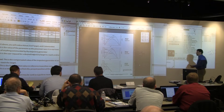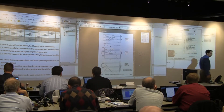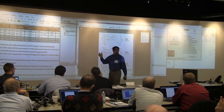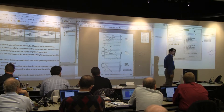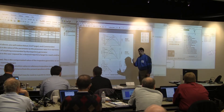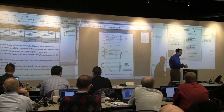Now the vice versa occurs within the same power: if you're only trying to get 30 watts out of this motor at 24 volts, it takes twice as much current as it does at 48 volts. How many people handle switch mode power supplies? Everyone should be — Meanwell, Pulse, suppliers like that. If you notice how they sell power supplies, they do not sell them by voltage or current; they sell them by wattage. Why? Because wattage is heat — it's power. A 48-volt 10-amp supply costs about the same as a 24-volt 20-amp supply. Power is power.